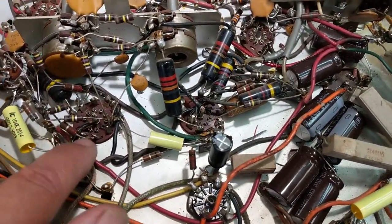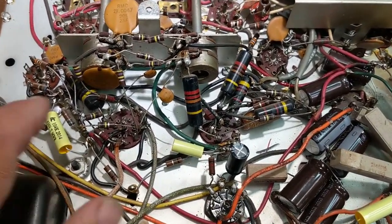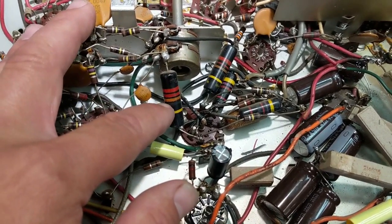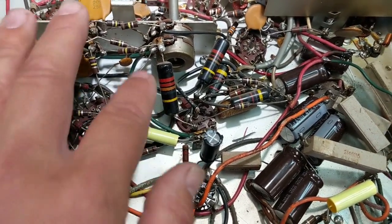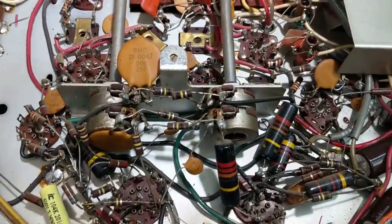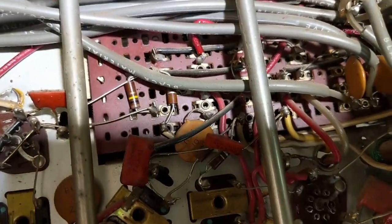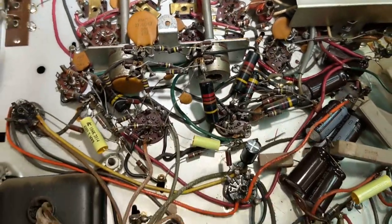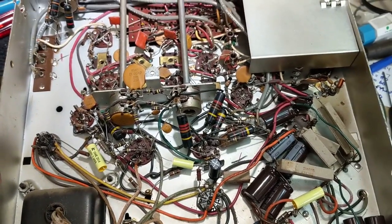What I'm doing is replacing all these bumblebees. I never did remember how to read resistors, but you read them the same way. So you've got two reds — it's 22,000, which equals 22,000 picofarads. Replace those with 0.02 microfarad caps — it's the same thing. Not a whole lot left. And then, of course, we'll need to clean the controls here, including this jerry-rigged piece of crap here. Then reinstall the tubes, rush it back outside, plug it in, and see if it works better than it did.